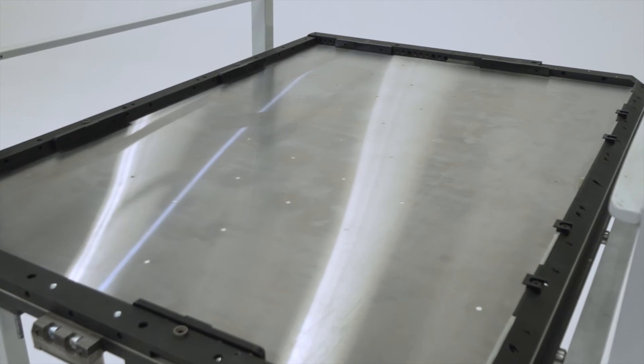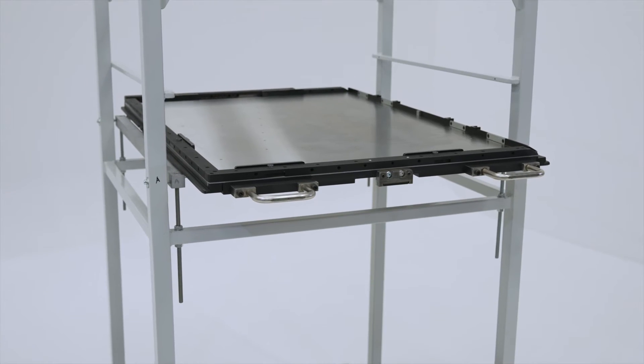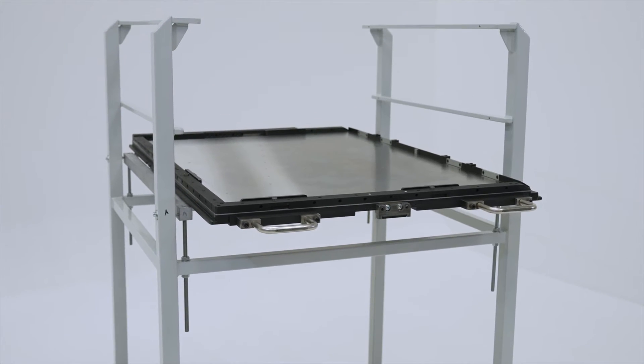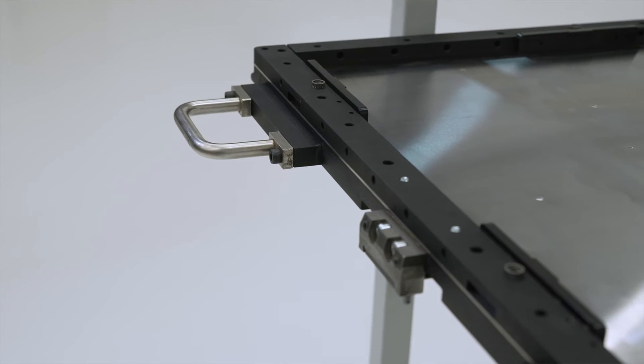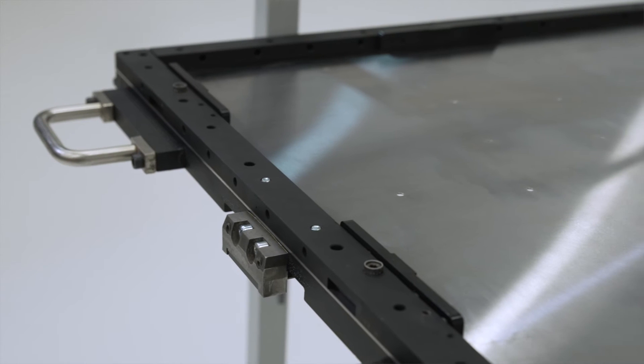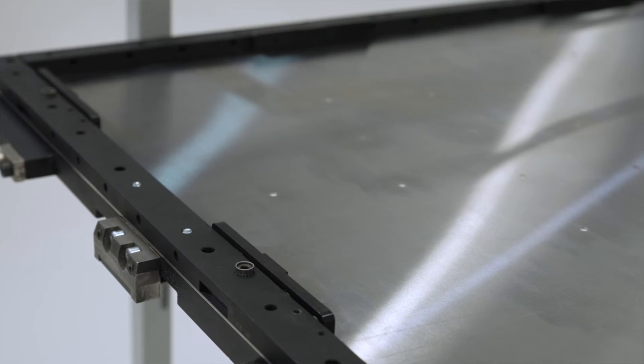Perivo chase plates are always manufactured out of hardened and ground rust-free base material. The new era of cutting chasers with a quick lock modification also consists of spring pushers instead of the more common side pusher blocks on the operating and opposite operating side.